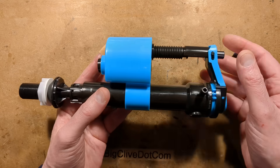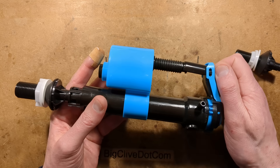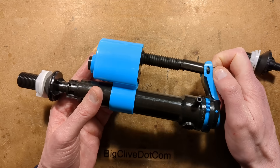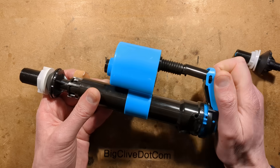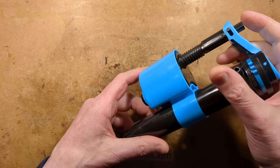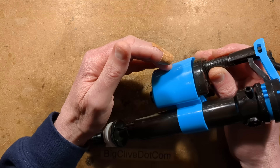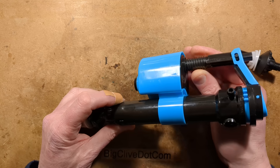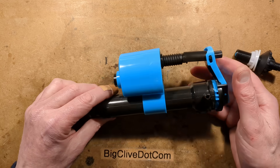Once you've got this installed, you can adjust the height it's going to fill up to by simply rotating the top. Rotating one way winds it down so the water fills to a lower level, and rotating the other way winds it up — you just set the desired water level. Also worth noting: when you flush the toilet, this doesn't go down straight away. There's a delay before it drops, as it starts draining out a hole first, meaning it's not spraying water into the cistern while it's trying to flush. They call it delayed fill.